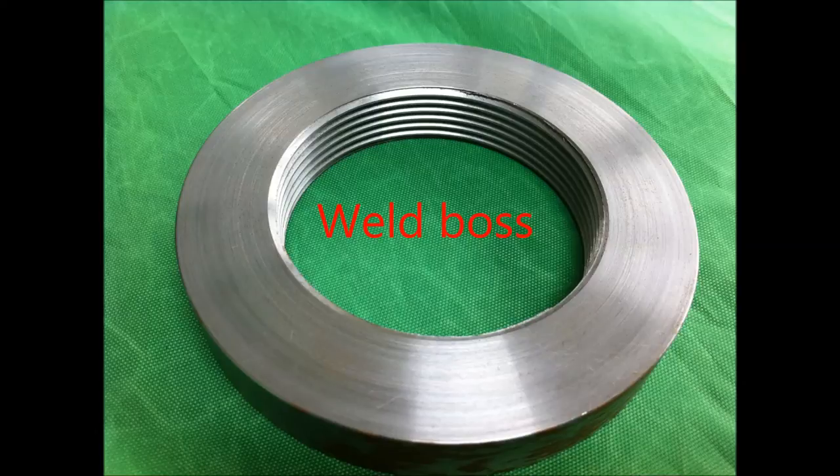The complete heater is usually fitted by screwing it through a weld boss welded to the side or top of the tank. For welding purposes, stainless steel tanks require stainless steel bosses and mild steel tanks need the much cheaper alternative of a mild steel weld boss.